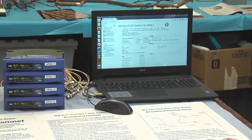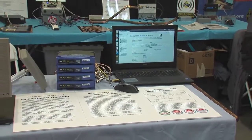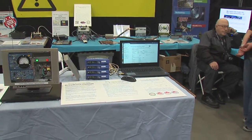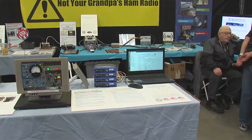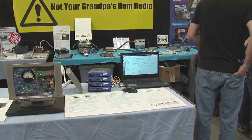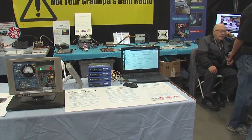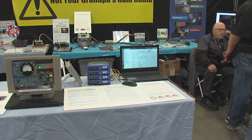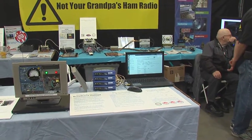Having modified the software, we run on a specific channel that's shared with the ham bands. With this system — both with the Linksys and hardware from Ubiquity — we can get some fairly long-range communications. It's very robust. It's like an internet system that's independent of the internet. With it, we can send voice, data, and video — for example, at a race course, over a venue like this, or at an accident scene.